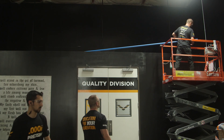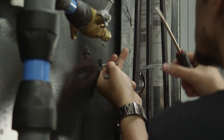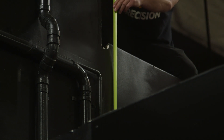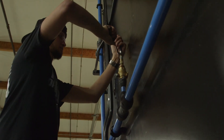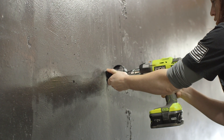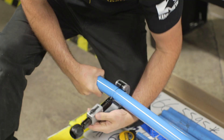So we had to go through and tear down the entire old system. We've got guys on the walls tearing all that down and prepping everything. After that, we started measuring out the system — going around, finding out where we're going to need 90s, where we're going to need 45s, basically laying out where we're going to put the pipe. Then we broke down into teams: a couple of guys putting brackets on the wall to support the pipe, other guys cutting pipe and preparing the fixtures, and then we just started putting it up.